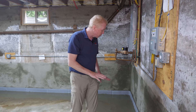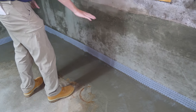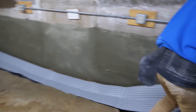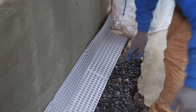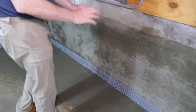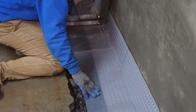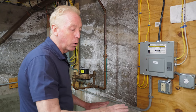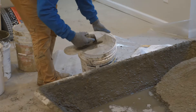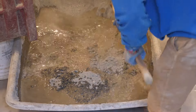The way this system is set up: we have our pipe and stone, and then you can see our great flow channel — like a waffle board — which allows any water coming in underneath the wall to go straight through the channel and then down 12 to 14 inches below the bottom of the floor. When we installed it, we also put in a vapor barrier — that plastic sheeting — so you can't even get moisture up through there. And the concrete we use is our proprietary Supercrete mix, which makes the concrete non-porous.